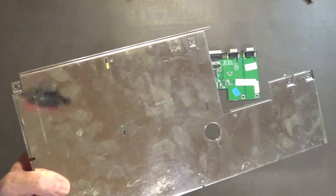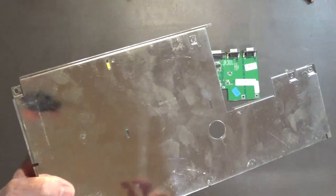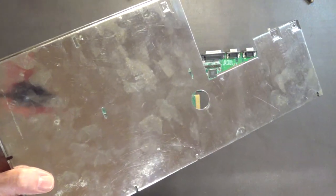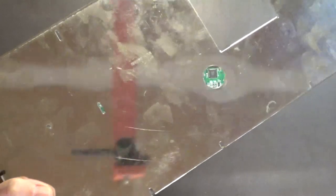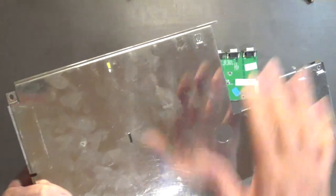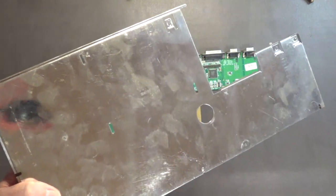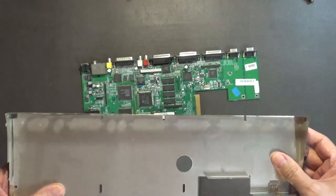Then you take that light machine oil, that light oil that I showed you, that LaBelle oil, sprinkle 5 to 10 drops on a clean cotton rag, and you want to wipe this all down with that oil. Every part of this, even the other side, both sides, and the back part especially. And you take a clean cotton rag, and you wipe it off again to put like a real thin coat of that LaBelle oil on this metal. And that should help keep it in really good condition, keep it from rusting.